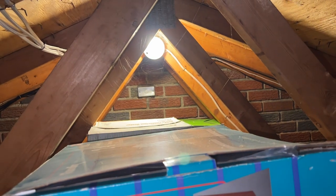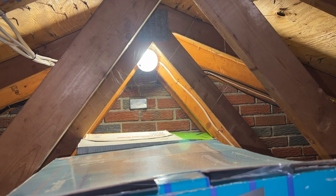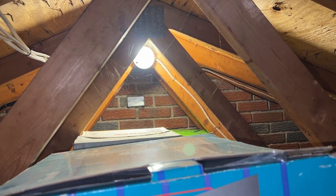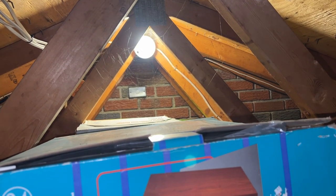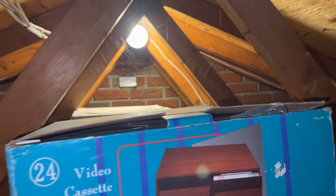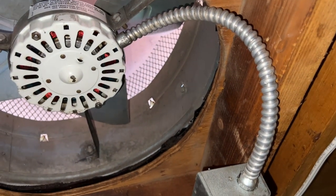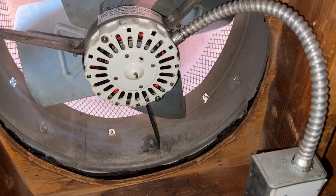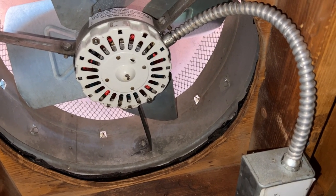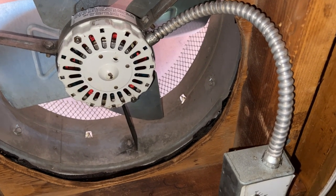That outlet is because I take a little shop vac up here — yes, I actually vacuum the attics. The mess up here is because of a move and I'm still cleaning things up, but that's another reason why we like to have the attic fans on so it doesn't get too hot up here. What's the benefit of an attic fan? Well, instead of it being 130 degrees up here it's 110, so it's about a 20-degree drop by running the fans — they are effective.